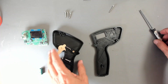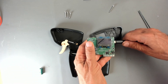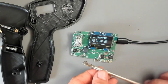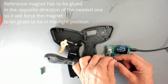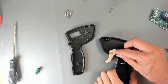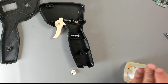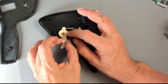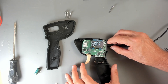On the other side use a washer and screw to keep everything assembled. For the magnet you have to avoid wraparound, so set the device into calibration mode. Vertical magnets — you can place a blade on top and they will try to stick, which shows their polarization. You need to find a position that does not give wraparound. I made a jig so I know the correct position. Put the magnet in the right orientation to avoid wraparound, apply some glue, place it in position, and perform a test — no wraparound, perfect.